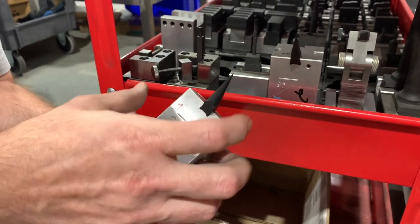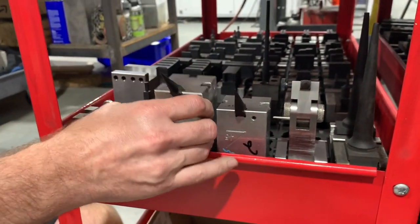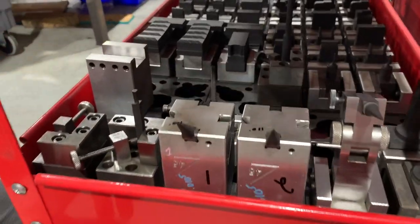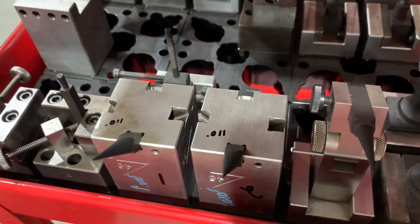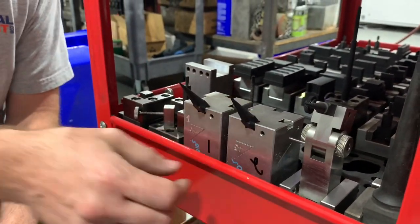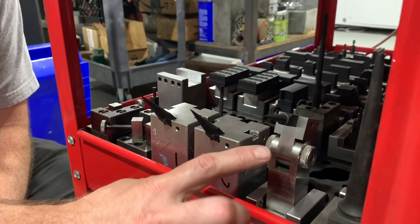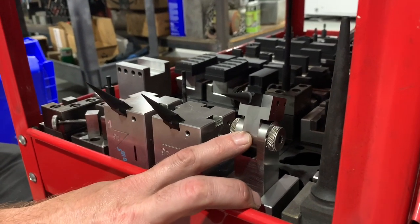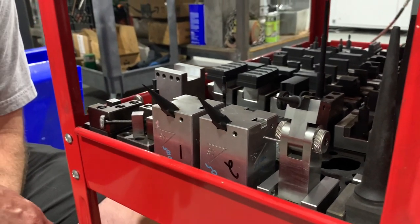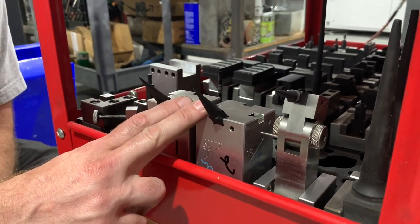And we've actually gotten measurements off of this so we know right where they're at. This is a huge time saver, being able to put that in the CAD and not having to figure out where those numbers are based on touching a point or trying to pick up a corner, a theoretical tip. And then we have the custom tunnel gate holder, which allows us to go to whatever angle we need it to be. But we try to design everything to work around these four different angles.